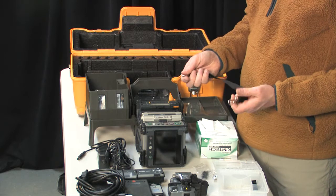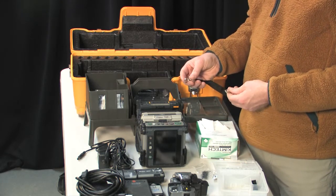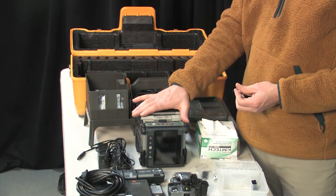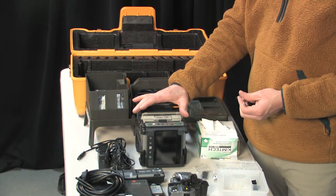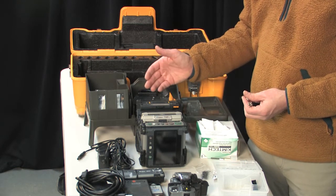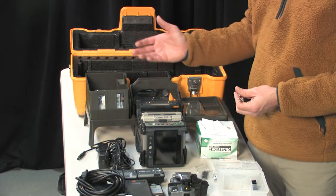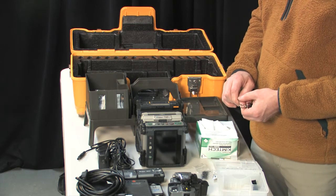This particular unit does have a strap. The technician likely doesn't have the strap on the fiber splicing machine because this is more often used within the head end of a central office for backbone mass splicing, as opposed to field work where we'd be taking ribbon and converting it to single strand, then fusing it to bufferized single strand splices.